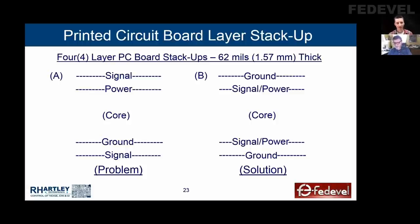This may be the reason why on some PCBs they have ground on top and also on the bottom — because they would like to use fewer layers in the stack-up, and then they have to sandwich signals between those grounds. That's what makes people believe that just pouring ground on top and bottom lowers EMI, because they think it shields. It's not a shield. It's a reference for signals and power. In this case, ground on top and bottom was the right thing to do.